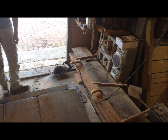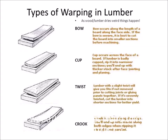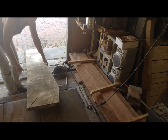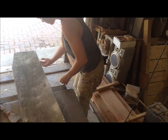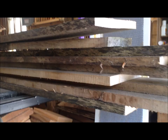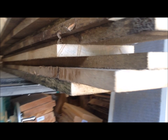In which case I'll have to use a planing jig. These are the common warping issues with lumber. I have found that bows and twists I usually have to use my planing jig for, but if boards are cupped I could get away without using it. Where you get your lumber from is going to be indicative of what kind of bends are in your wood. Poorly stacked lumber as it's drying will just make these twists much more apparent and harder to take out. The two top boards I ended up planing with the planing jig — I use a planing jig because I don't have a jointer, and I have a video on my channel showing how I made that.